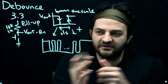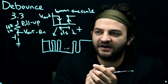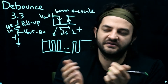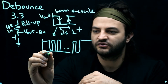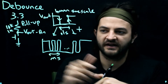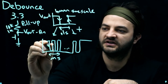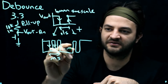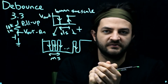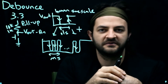Is this a big deal? It turns out to be a big deal when you're using interrupts on the PIC, because the interrupt occurs within a few cycles at 80 MHz. The code inside — maybe adding one to a volatile global variable — takes maybe 100 microseconds total. The bouncing happens on the millisecond scale, at one to five kilohertz. So the code runs at the microsecond scale while there are several milliseconds of bouncing. If you're triggering on a downward edge, there are multiple downward edges per press. So pushing the button once, the PIC counts one, two, three, four times because the button is bouncy.